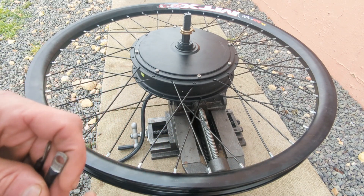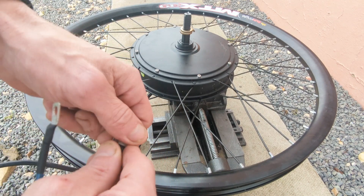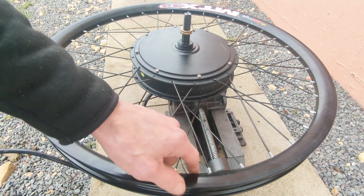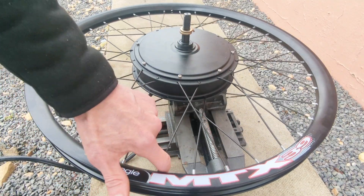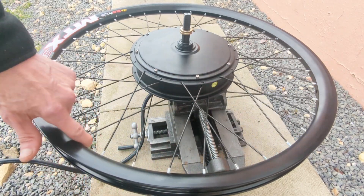What I'm going to do is short two of the wires together. I'm going to hold the green wire and the yellow wire and then turn the motor - and it's very stiff and lumpy. It must be acting against itself every time it goes past a magnet.